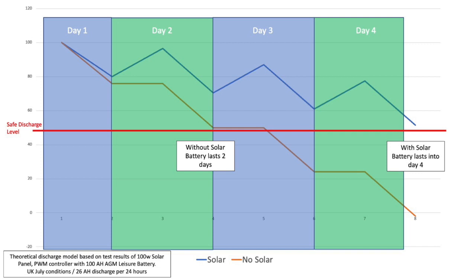In conclusion, if you are just looking at extending your off-grid capacity by potentially a few days in the sunnier months rather than being totally self-sufficient, this kind of setup can make quite a difference for not too much money. Something I couldn't test is the longevity of the panel — being out in the sun and exposed to moisture can lead to delamination or discoloration of a flexible panel, and in general their lifetime is less than a solid panel. But what you do gain is reduced weight, making them easier to install, and obviously they are flexible to fit the contours of your roof.